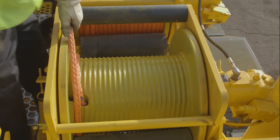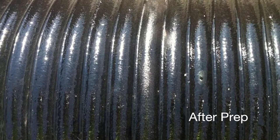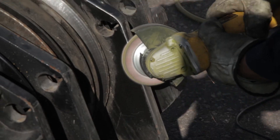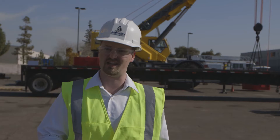The first place you're going to look is at the hoist drum. You want to make sure that the flanges the rope contacts as it goes from one layer to the next in the spooling process are as smooth as possible. You want to keep that below 300 micro-inch RMS value to ensure that you do not increase the rate of wear on your synthetic line.